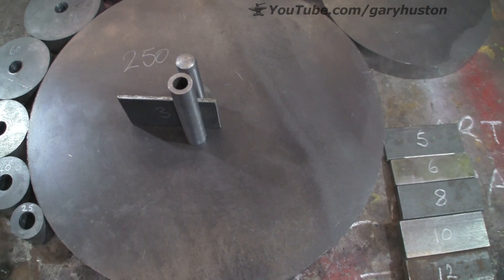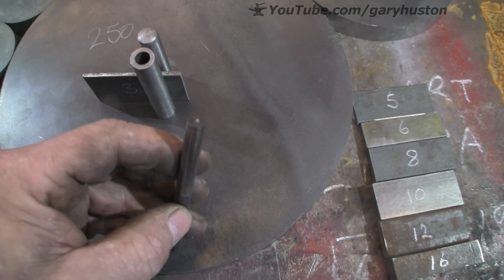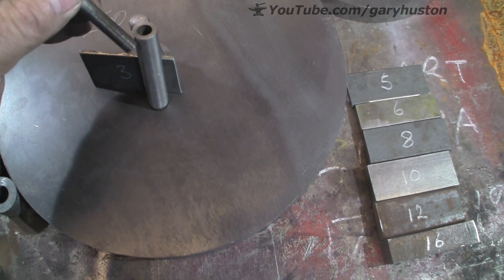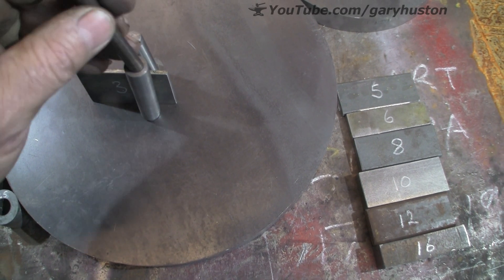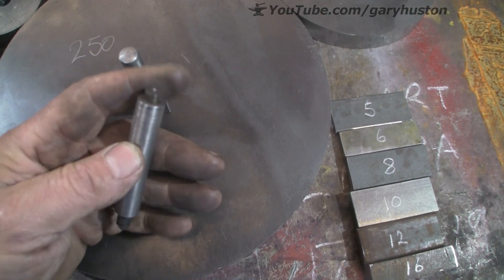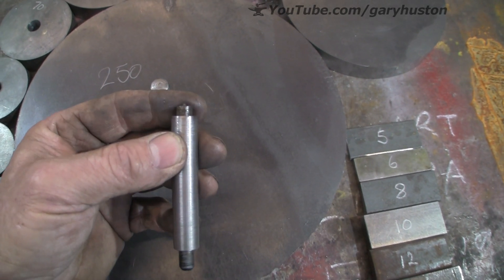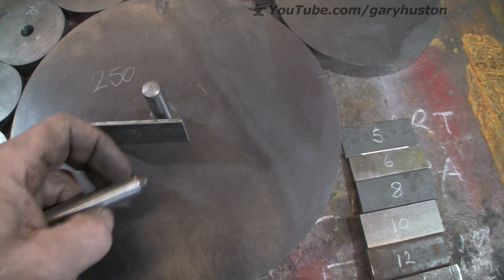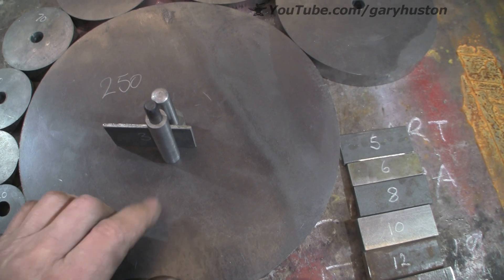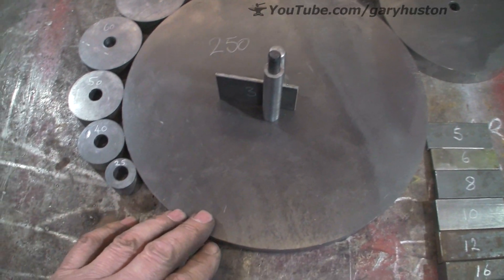Because I've made it three-quarters of a millimetre wider, that will give me my wiggle room. This is just a piece of good old coil spring which I machined down, then hardened and tempered, and it will go in a nice relatively tight fit. If you could see, there's a tiny little dimple I put on the end and that's going to give me my centre dot. So we just line it up, centre dot it, then when I drill the 12mm hole for the pin we'll have three-quarters of a mil wiggle room, which I think is going to be important.